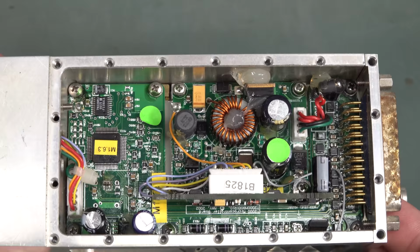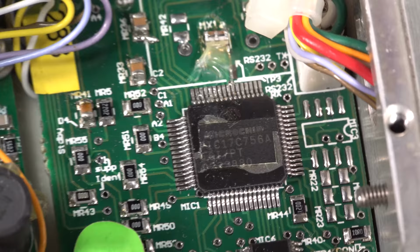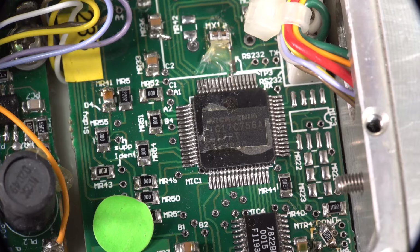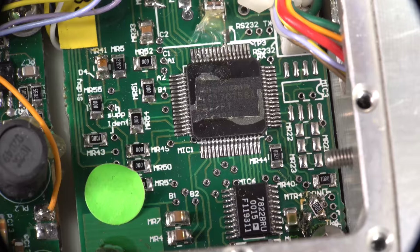We've got a processor. We might have a squiz. There you go. The Microchip fanboys go wild. A PIC17C756, is it? This design, by the way, dates from 2000. I think it's still in production. Actually, I don't know. These things often wouldn't change over time. This is the sort of application that would pretty much not change. You just keep buying the same PIC microchip part. That's why you can still buy PIC micros from 25, even 30 years ago. So anyway, not that unsurprising.